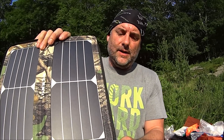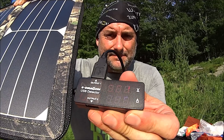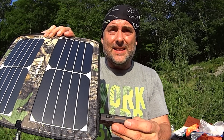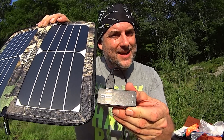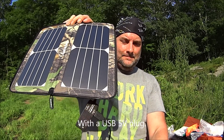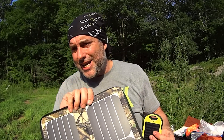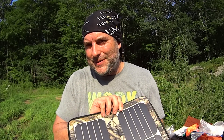At late-day sun we've got about five volts at 0.85 amps — that's 4.99 volts at 0.85 amps. That's actually the same power you'd get out of a wall outlet, so it's drawing down the energy from the solar panel quite well. Let's move somewhere shadier to look at the results of it charging things.